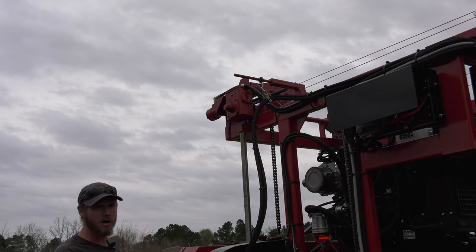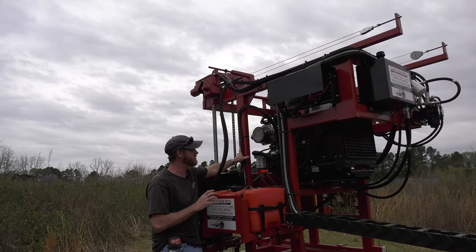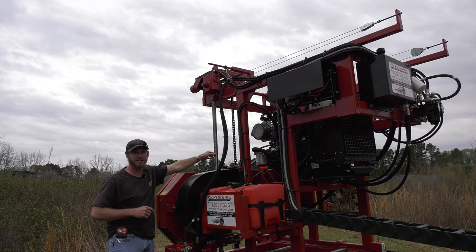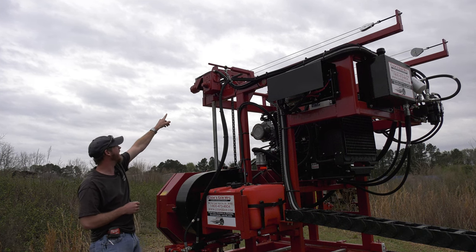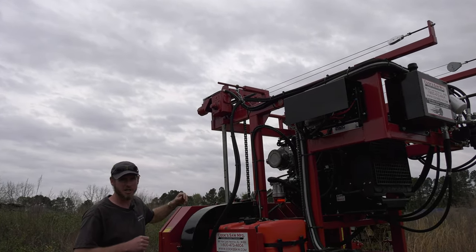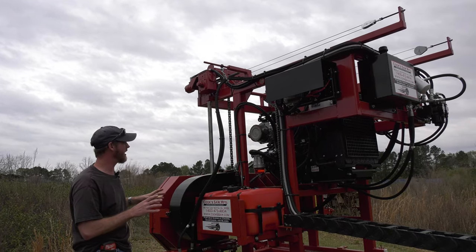So on our saw carriage or our saw head, we are using 2x4 posts. It is a 4-post system. So you've got your 2 posts on each side, plus your 1.5-inch guide shaft here as well that's raising the head up and down. We are using a hydraulic motor on a gearbox, and that is picked up with 60 chain. There's 4 60 chain pickup points. So that raises our head up and down evenly, keeps the head balanced. I don't have unnecessary wear on it.